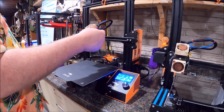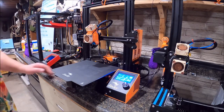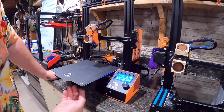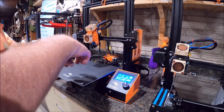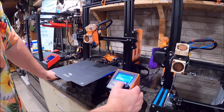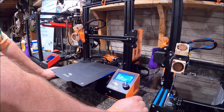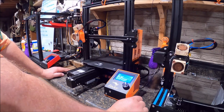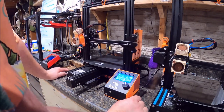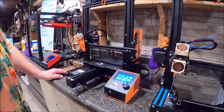Alright, now that we've got all the wires tidied up, soldered together, and heat shrunk — this is a clean look. And not to mention it's blaze orange, which is a great hunting color for deer hunting. Anyway, now that we've got the new tip on, I've cranked these down — looking from the bottom I'm turning them clockwise, from the top counterclockwise — to bring this down a little bit because this tip could be just a little bit taller than the other tip since we have a whole new assembly. So I'm going to go ahead and auto-home this thing. Let's see what we hear. Silence — not a single whine, not a single anything. Oh, that's beautiful. Now this machine is among the quiet machines.